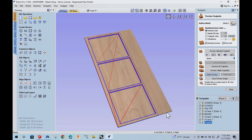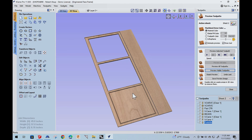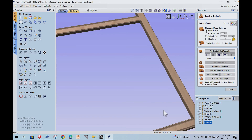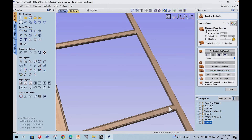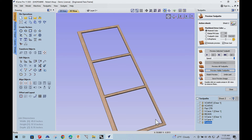For the simulation, I've selected only the toolpaths we'll use — the same ones we'll select when we generate code. We don't select those that were generated as part of the vCarve clearance. Let's run preview all visible. Those will be openings, that's scrap. And you can see there's a bead around that frame. So that's how we generate the beaded face frame.